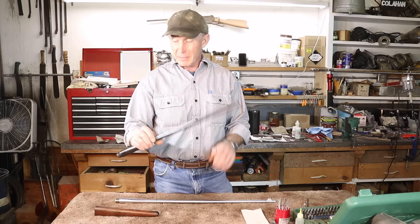To me the next best option is to find a suitable original replacement barrel, but that can be pretty difficult — especially if you want everything correct and date correct, the finish correct, the caliber markings, everything just right. If you're looking for a .30-30 barrel for an 1894 Winchester, you might have better luck than if you're looking for some oddball caliber like a half-octagon .40-72 1895 barrel that they made very, very few of. You're probably never going to find that in any condition.